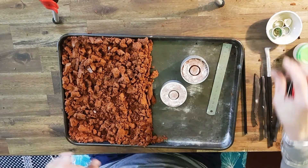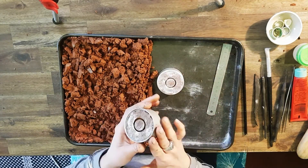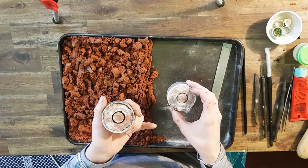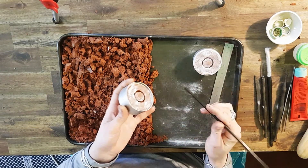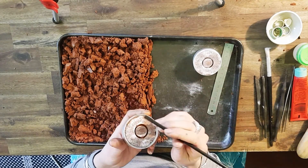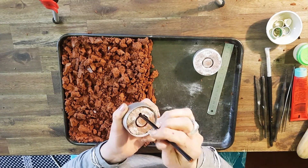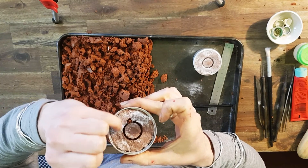We need to create a way for the silver to get inside of this flask. I'm going to do it on the female side — it doesn't really matter which side you do it on, just have to be a bit mindful that you're going to have to clean up that section. If you've got a design with some pattern on it, you probably wouldn't put your sprue hole on the same side as your pattern. I'm going to use this straw because it acts like an apple corer — it's a lot gentler. Just push it all the way through so it's right inside of that design.